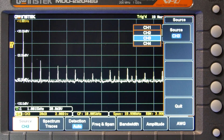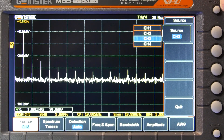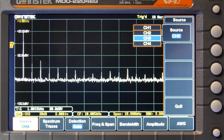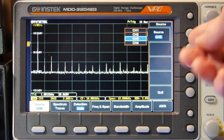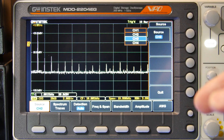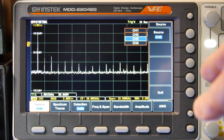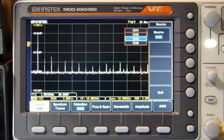The generator is about 0.04% distortion, so really the amplifier would be about 0.12%. Also, looking at the power supply, I see the current limit light is just barely coming on, so I think the peak current levels are tripping the power supply. That's not helping the noise situation either. When we get our real power supply, it should be better.